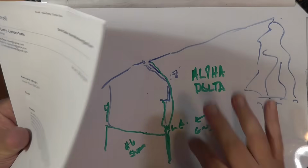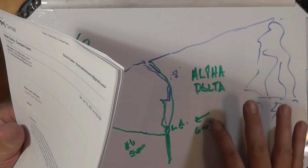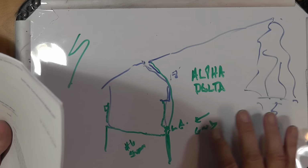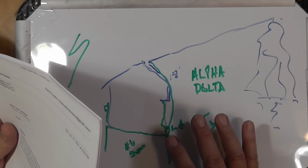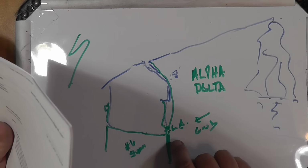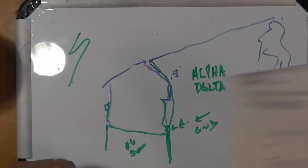That's what I have to suggest for you. First of all, you're going to need a longer piece of coax. So that if you feed it in the middle, you want to drop it straight to the ground, and then run it along the ground to where it is at the ground rod with the lightning arrestor, and then you put that in the house and make sure that this is bonded to your utility ground. And when I say utility ground, I mean the public service utility that brings you your electricity.